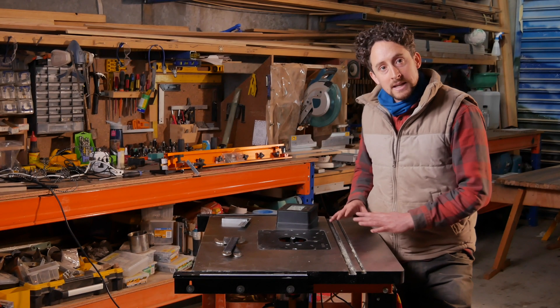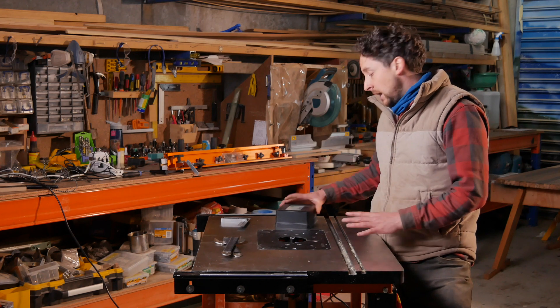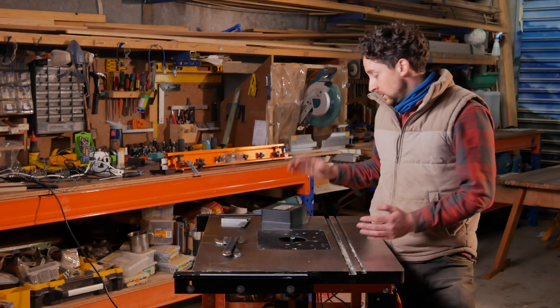That'll only happen if you're trying to push the router bit up really high or go really low. And you're only going to need to do that when you change router bits anyway. I actually like how simple it is — I'm not going through a whole bunch of menus to access different settings. There's a button for setting the zero, an up button and a down button, and then you have the option on each of them of inputting an actual value. The up and down motion is done in relation to where the bit is currently — so if I'm at 10mm high and I want to go to 20mm, I type 10 up and it goes another 10 up. If I want to go back to zero, I type 20 down.